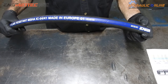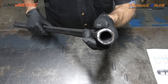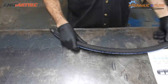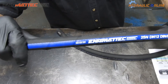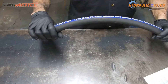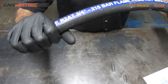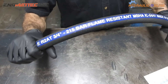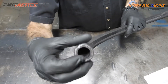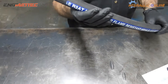This is our three-quarter two-wire hydraulic hose manufactured in Europe under our brand, which stands for Engineering Materials and Technology. It's manufactured to SAE 100R2 AT specifications — AT meaning good for up to 120 degrees Celsius. This hose has a three-quarter inch ID reinforced with two layers of high tensile braided wire.